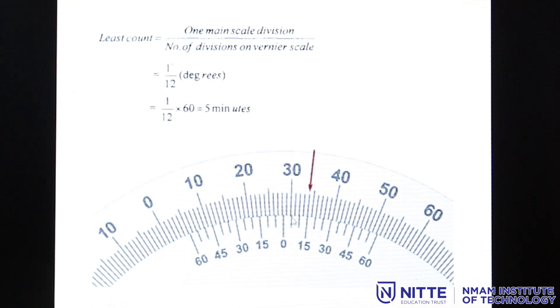At any point of time we use only one of the verniers, not both together. Which side of the vernier to refer depends on the side of the main scale. In this case, 0, 10, 20, 30 is towards the clockwise direction, so I will look into the vernier divisions ahead of zero — this vernier scale — to find the coinciding vernier division.